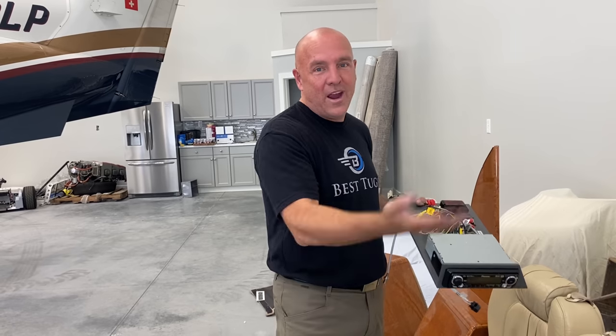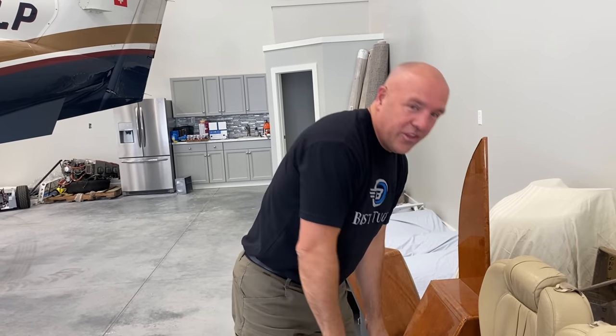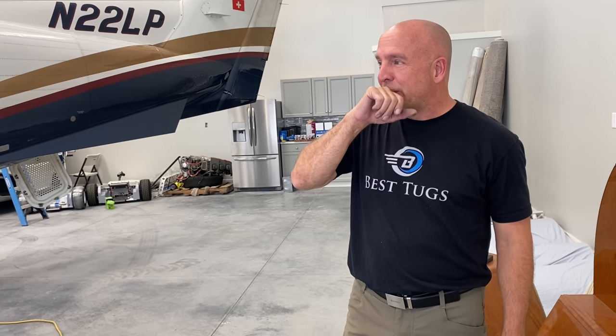And then we pulled all the wires related to it, because I think airplanes should always be on a diet, except horsepower. That engine does weigh more than the original engine. I think that's partly in the gearbox because it's handling more horsepower, which is why it can handle the full power of 1200 horsepower all the way through the climb instead of a 5-minute limitation. And then maybe the fins add, but when you weigh it, it is heavier. Some people would say that the Bravo motor and the Papa motor are basically the same, but different documentation. That's not true at all. There is a significant difference. They're the same footprint. They look the same on the outside, but when you put them on a scale, that's a heavier motor.